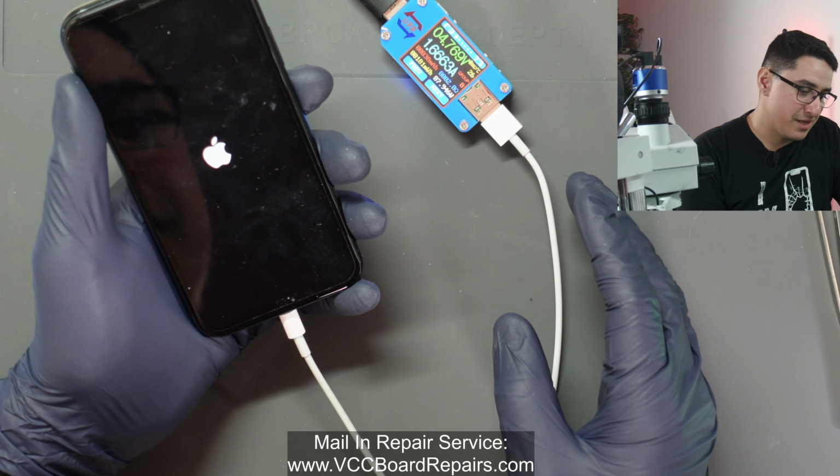Usually when you update a phone, whether it's a big jump from one iOS version to another, or it had some weird issue and you had to flash an update to solve a boot loop or being stuck on the Apple logo, then you might get swipe to recover, and you basically have to type in the PIN code twice, and it has to load the whole bar. If at the end it detects the PIN code was incorrect, it'll kick you back to swipe up to recover.